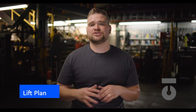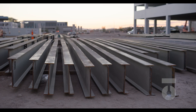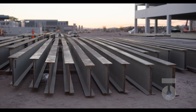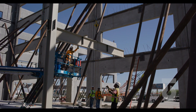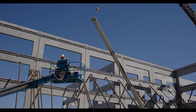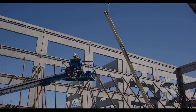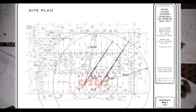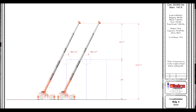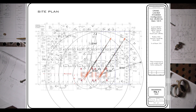The lift plan: as previously mentioned, we have over 300 assemblies — columns and beams alike — that need to be rigged, lifted, and connected for our four-story building. We will be lifting every day for 12 straight days. A lift plan not only ensures efficiency with the equipment we have at our disposal but also ensures our safety. Every lift plan may have subtle differences depending on state laws and company to company, but generally outlines the same details. The lift plan takes into account placement of the crane based on the work site for maximum efficiency, the weight of our loads, and details the safety parameters for max boom length and radius for our crane's capabilities.